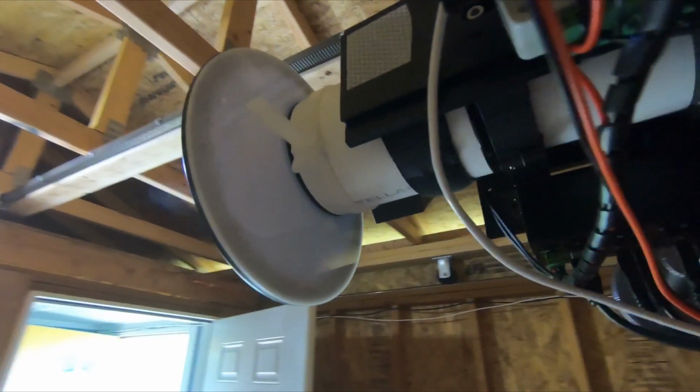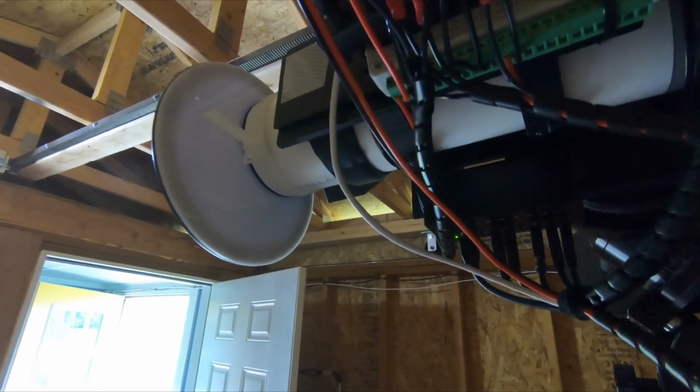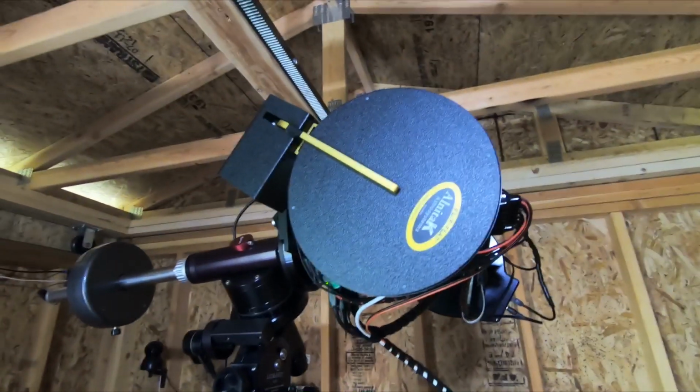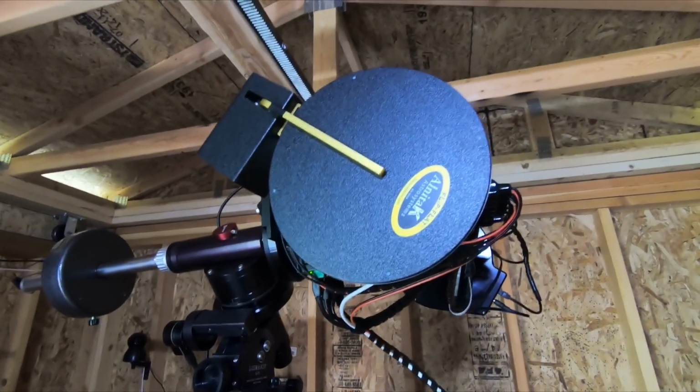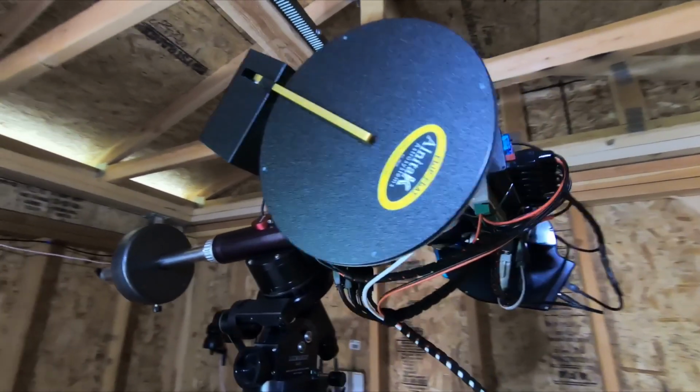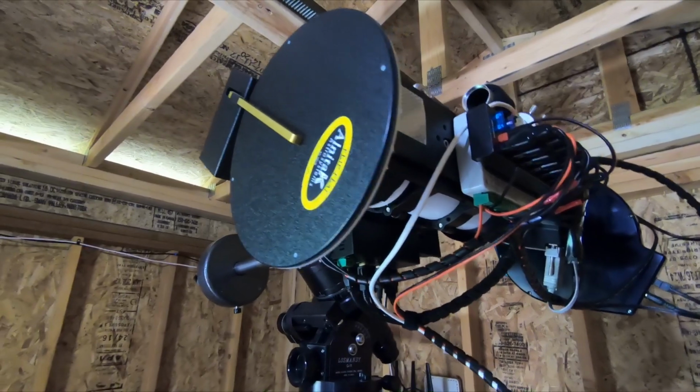And what we're able to do is from Sequence Generator Pro, we can control the brightness of that as well as whether it's opened or closed. So if you guys think about it, throughout the night, that's open. But then at the end of the night, when it's time to shoot flats, it closes and it sets itself to a selected brightness level to then shoot flats.